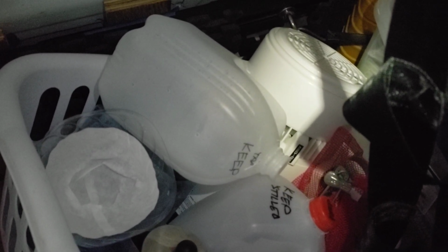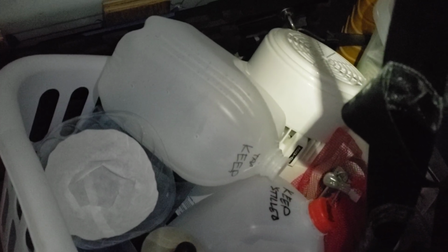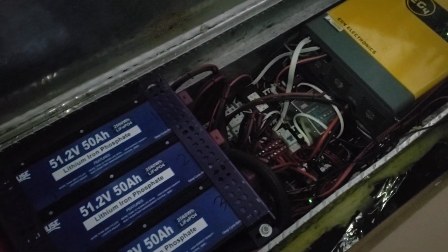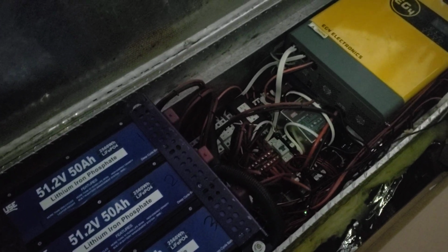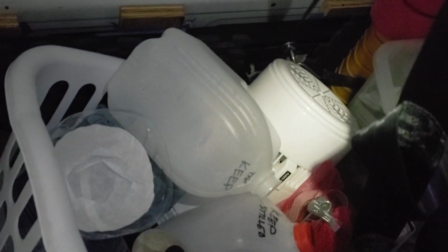Burns quite a bit of energy, 750 watt, takes 3.5 hours to do a gallon, but there's something called dump loads, so with solar and with wind, actually got the name from wind. So when these batteries are completely full and the sun is shining and there's nowhere else for the solar power to go, but there's plenty available, well, you can run other stuff. You can set it up to know when the batteries are full and there's sun available and start running your auxiliary stuff, commonly referred to as dump loads. So I can basically distill water when I have excess power.